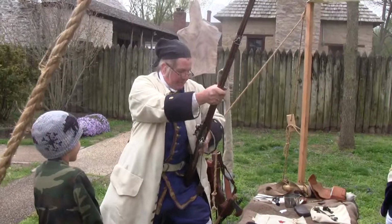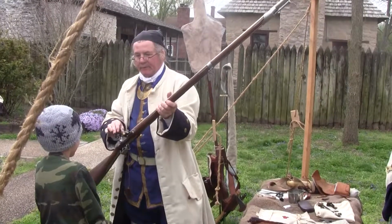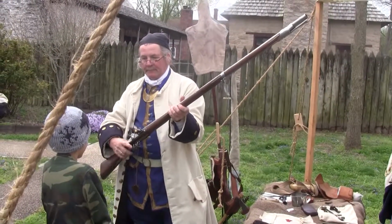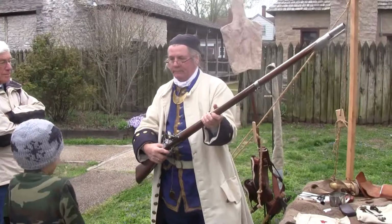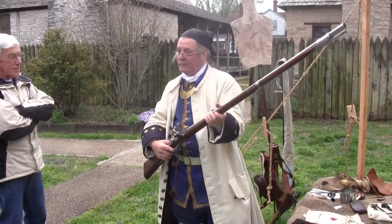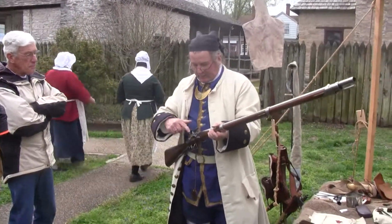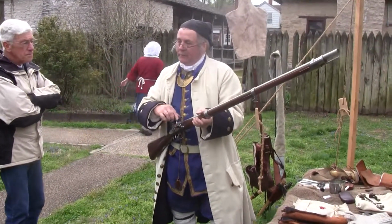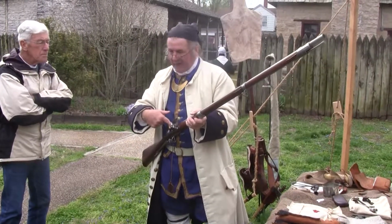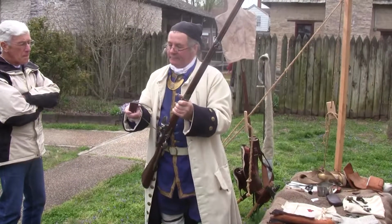Nope. No. There it went back. Full cock. All you're gonna see is a flash of sparks. Okay? Ready? It ain't gonna go off. See, we're standing on this end. Yeah, watch. See the sparks? One of them sparks catches the pan, powder in here. When it sparks, it shoots a little flame inside there and it sets the rest of the charge off. That's how this gun works.